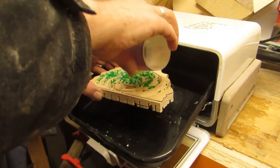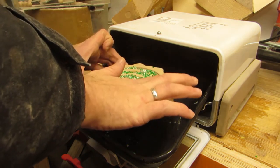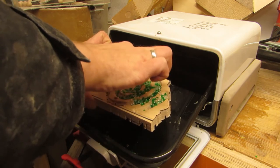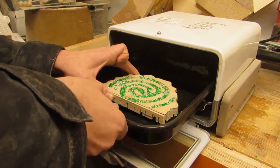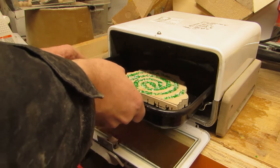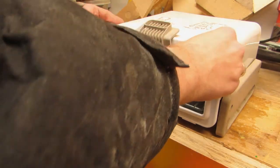I found that in some places intersecting relief cuts from the back would allow the grains to fall through — still, not actually a problem. I put the piece into the toaster oven in order to melt the plastic, and as a word of caution: if you do this, use a piece of sacrificial paper or wood underneath, because I did not at first and put it into a small pan that still had wax residue from another project in it.